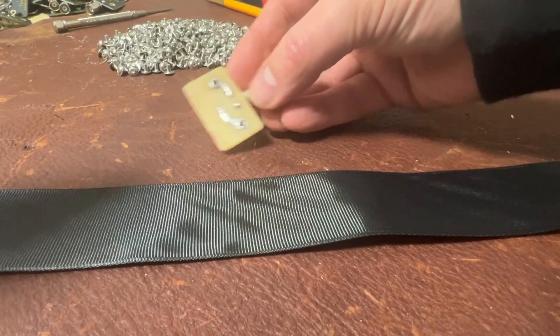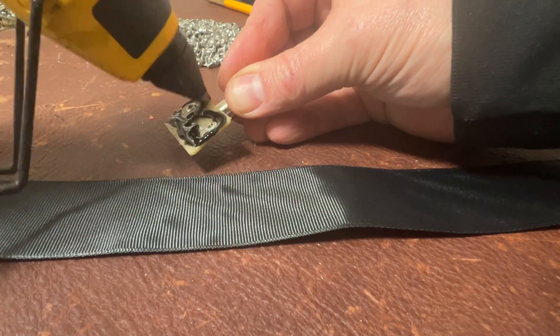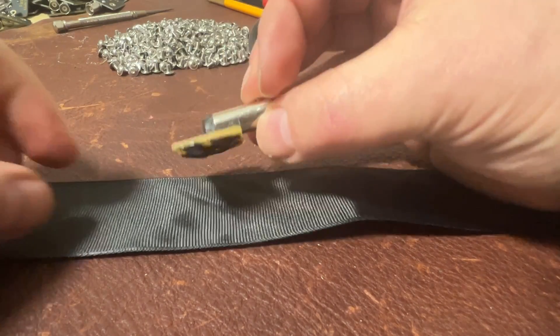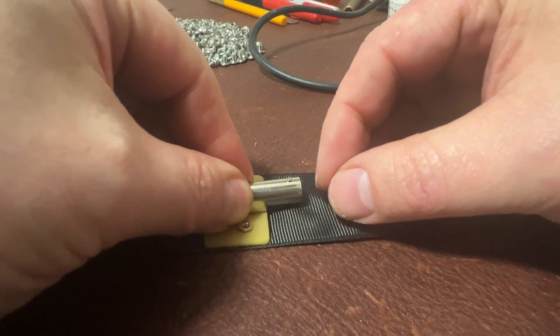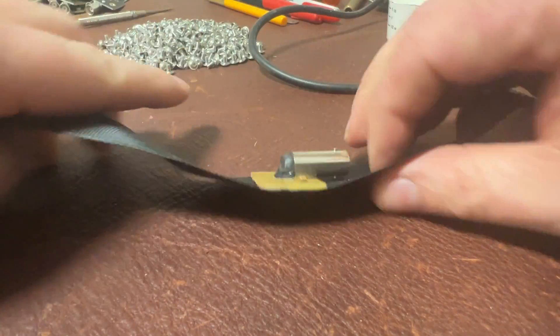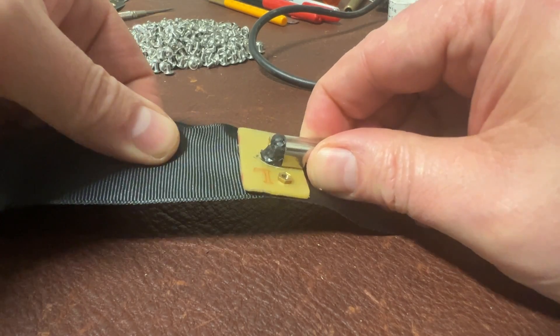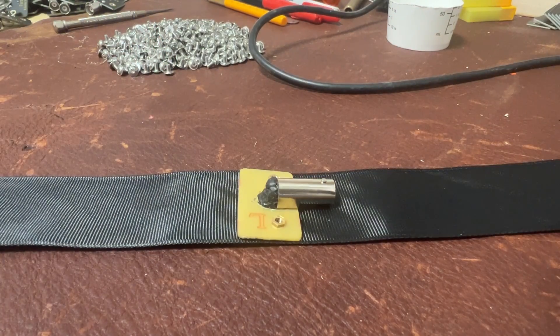Some of you might be asking why I made the board so tall — it's really just two tiny traces right here. There is a reason: I don't want the two mechanical screws to be the only things attached to the fabric. I needed a fat pad to be able to throw some adhesive down, which then glues to the fabric. A very large patch of fabric holds this connector, and the little screw connectors are doing nothing more than the electrical connection. If you don't glue that down, it's going to rip away and won't last nearly as long.